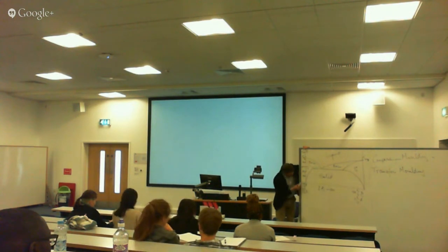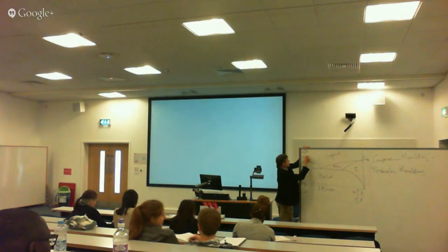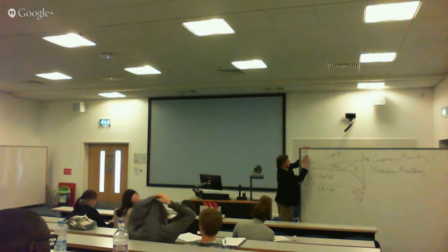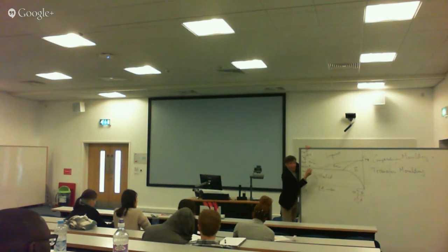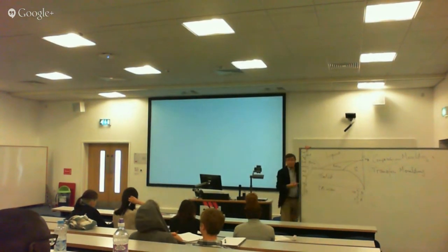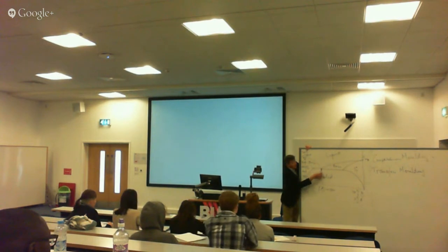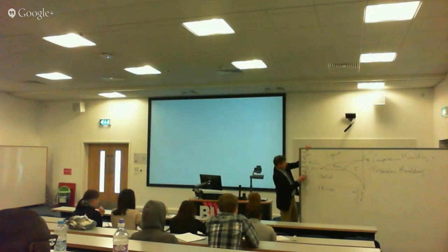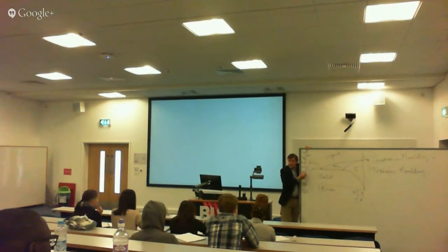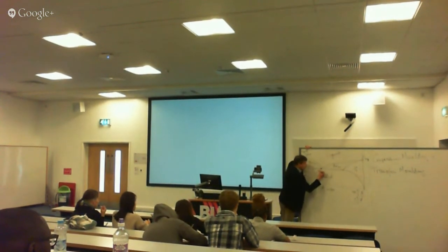I put some numbers here: 200 degrees, 400 degrees, 600 degrees, 700 degrees, no sorry, 800 degrees, and suppose this is 1,000 degrees. This temperature, where this line is, this point in particular, above which is all liquid, below which is all solid, according to what I put here is about 550, 560 degrees, if you believe these numbers. This temperature is known as the eutectic temperature, and this point is known as the eutectic point.